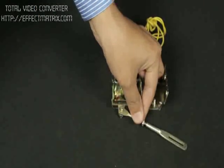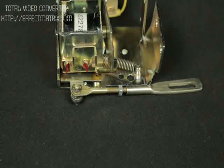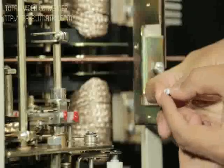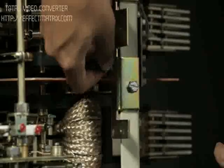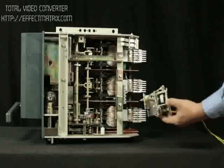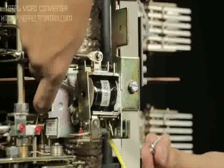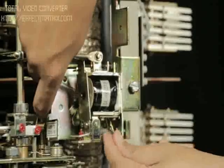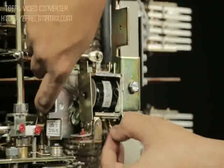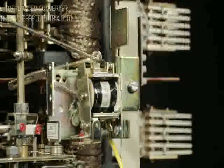Fix the connecting link to the release assembly using a circlip. Now insert the screw of the shunt release mounting inside the plate provided on the breaker for release mounting. Insert the slot of the shunt release plate between the screw and mounting plate. Fix the other end screw of mounting and tighten both screws with a screwdriver.